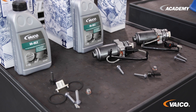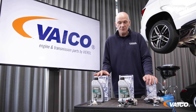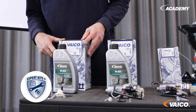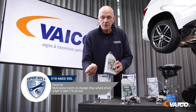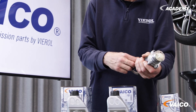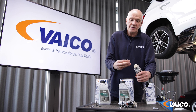Now let's take a look at our expert kit. We have this kit here, which we will use in a moment. It contains the fluid and a strainer. This strainer is installed on the radial piston pump, and we will soon see how dirty and contaminated it is. Therefore, we recommend replacing the strainer.